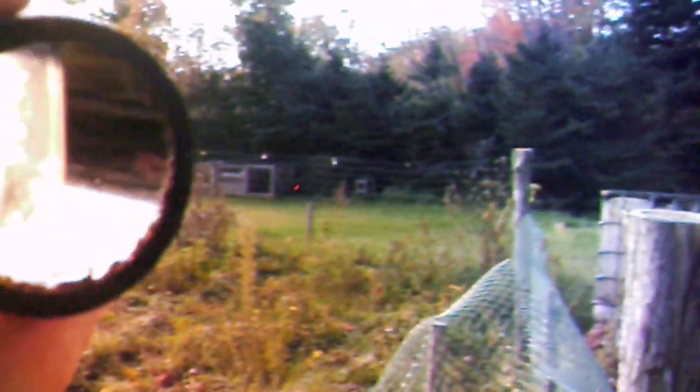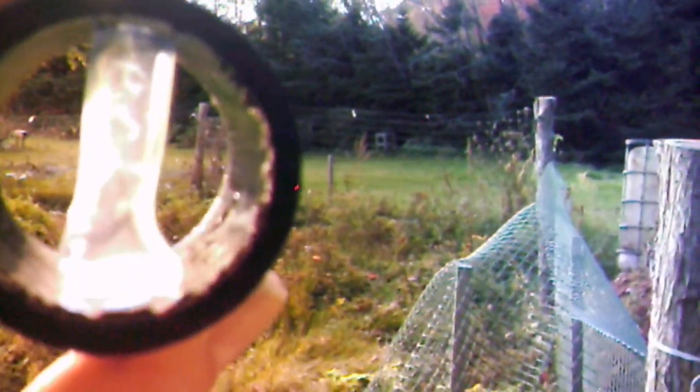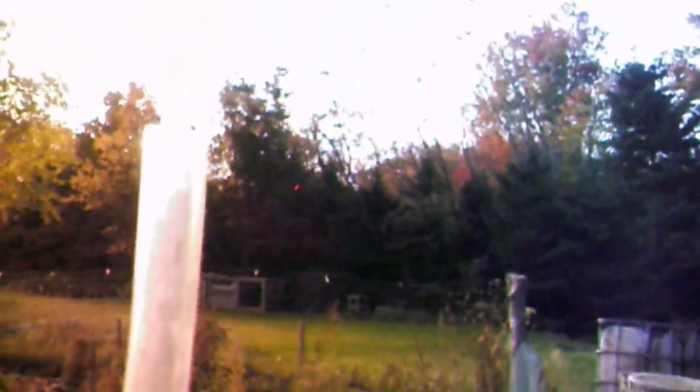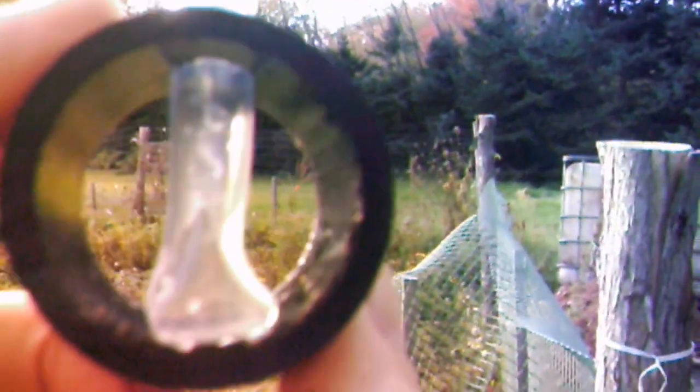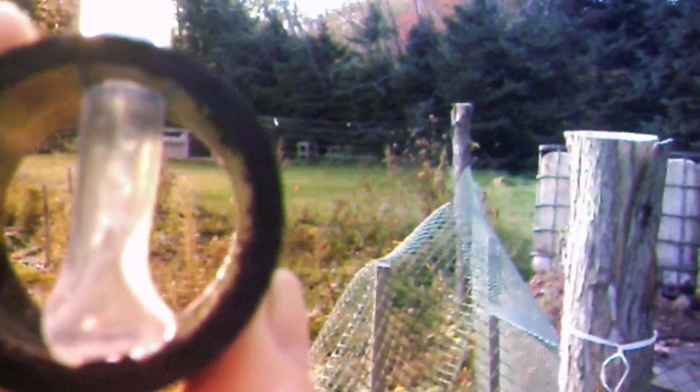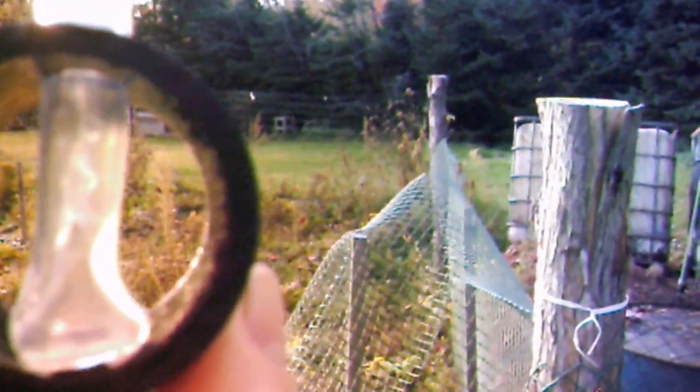You can see that the piece of pipe goes the whole way through. From this side, you can clearly see that this would be down pressure, and this would be up pressure or up flow. So the water hits it, flows around the piece of vertical pipe, and because there's a little gap in the bottom, pulls air through that little area. Because it creates a vacuum around that spot, air rushes in to fill the hole, and that air gets mixed into the turbulence that's caused.